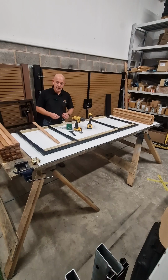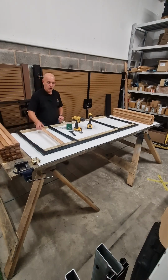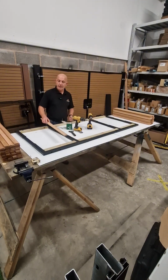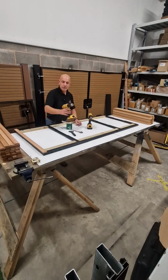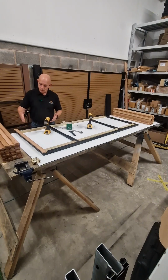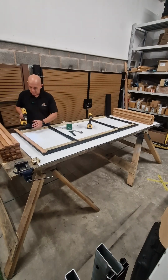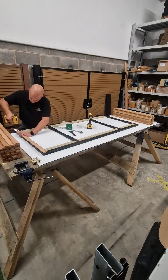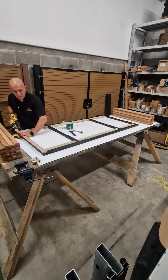And that's it, really. So basically, what we're going to be doing is laying out the rails all the way down, starting at the top. The first ones, I need to pre-drill a hole into the steel. And then once we're into the softwood, at this position again, another pre-drilled hole for this one. So let's make a start. That's the first one in.